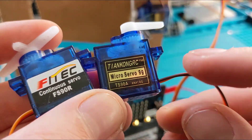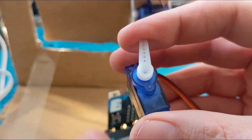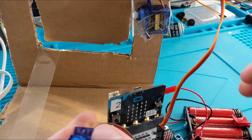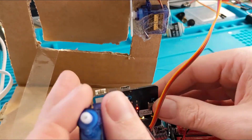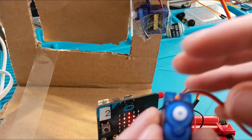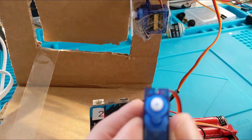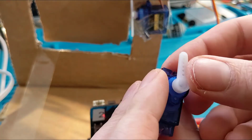There is a slight difference between these two servo types. This is an SG90 which points like that way — stuck at one end or the other. If this servo is not behaving and pointing the wrong way, pull the arm off, plug it in, and set it to the middle — 90 degrees. Now I can hear it moving, so the wheel is turning. I put it into the middle, so now I know that's 90, and now I put the arm back on.